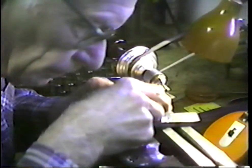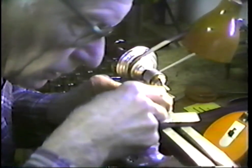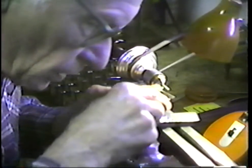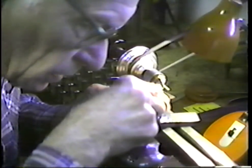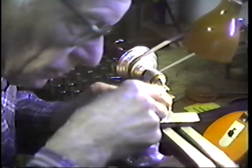Continuing to cut. Let's talk about the philosophy of the cut that we're to have. I'm looking for ever so slight taper. I would like to enter the hole that we're going into, and go about 3/4 of the way to the bottom and get tight, and then drive to the bottom.